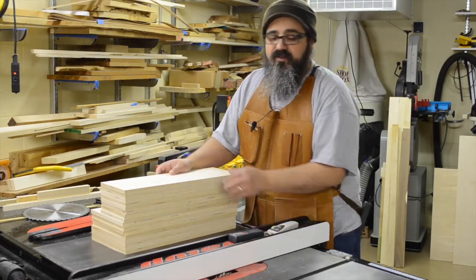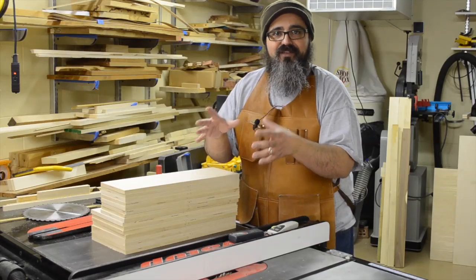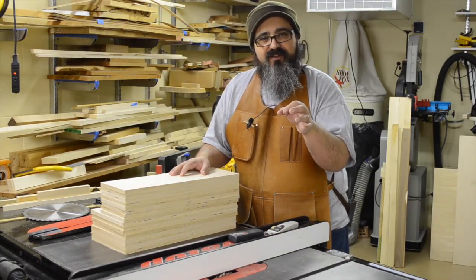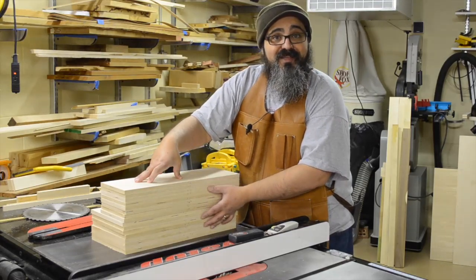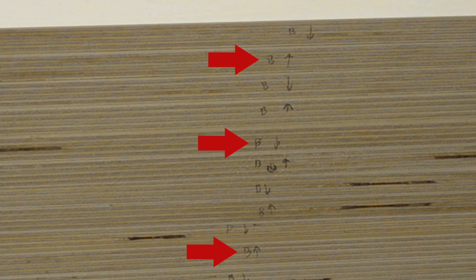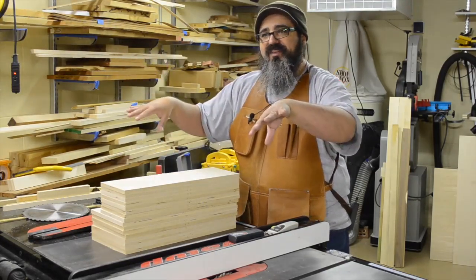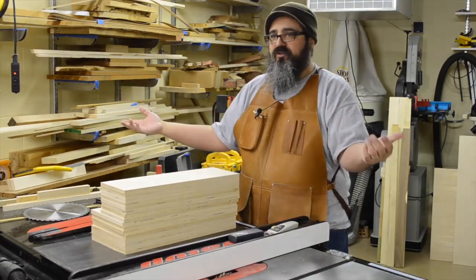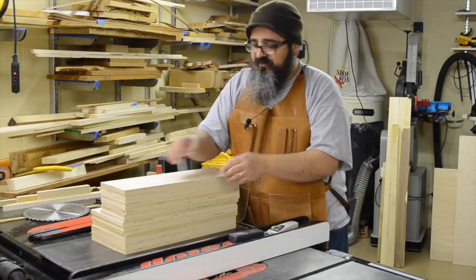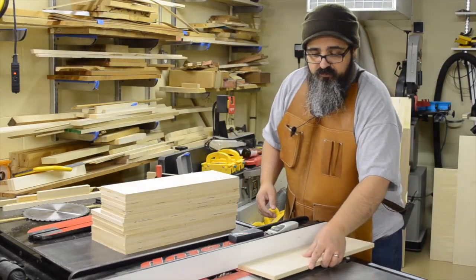I went ahead and set up the fence so that it's registering on the bottom. Even though Baltic birch has several more layers and is very good about not having voids — and the voids that are in here are really small — I decided that if any voids were revealed during the cut, I want them on the bottom, not so prominent. So I came in and made marks indicating where the bottom side is and which is the interior face. I want my show faces on the outside of the boxes — clothes will be on the interior, and when somebody opens the drawer they'll see beautiful grain on the outside. So I indicated with arrows and a B what's the bottom and which are the interiors. Now we'll just start making our cuts.